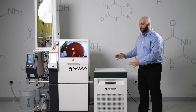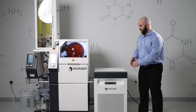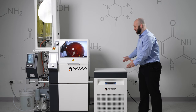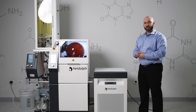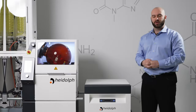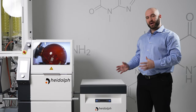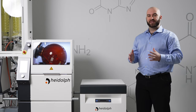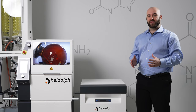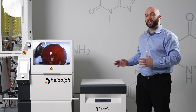The overall footprint of the HiChill 35 is 23 by 26 by a little over 32 inches in size. The electrical requirements are a 208 volt single phase outlet, and we strongly recommend that you put that on a dedicated 20 amp breaker.